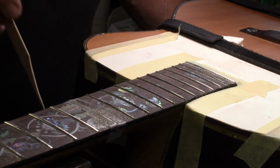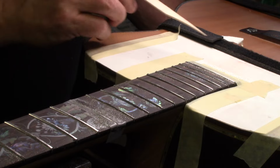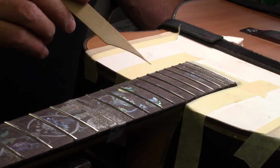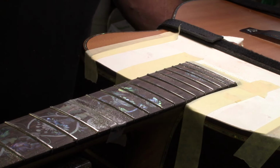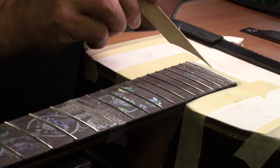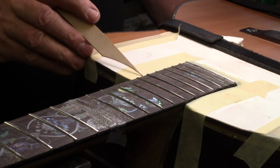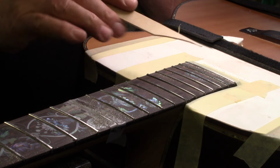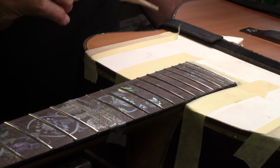It's going to make a lot more sense as I get on the home stretch. And you'll see just how much correction we did get by this out there method. There's nothing else you could do. As I mentioned, this is a Spanish heel. You'd have to disassemble the whole guitar to change the neck angle. It had to come out of the fingerboard. We lost a whole pile of inlay here, and that's just part of the game. Even if you pulled the fingerboard off, there wasn't enough material underneath to reduce this proverbial hump at the neck to body junction.